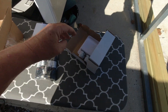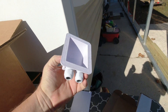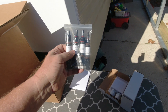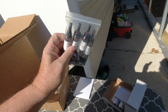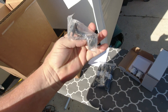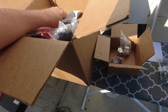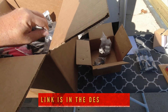Let's look at some parts that came in. This is the little box that goes on the outside of the shed — your negative and positive wires go up through it, making a waterproof seal. These are some inline fuses. I'm going to be hooking up two strings in series then connecting them in parallel, so before the parallel connection I'll put these inline fuses on each string. I also got a couple extra for future-proofing, and finally the piece with two ends that I was waiting for.